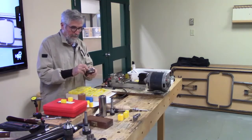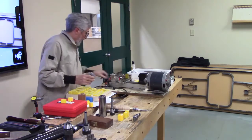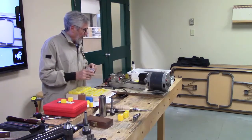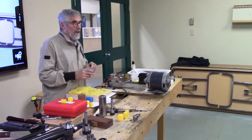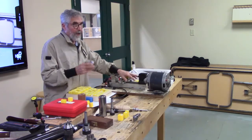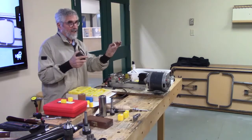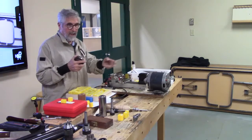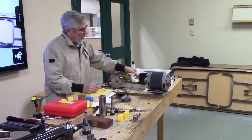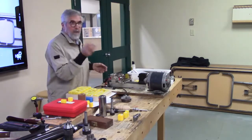But I often will start off with, let's say, a piece of, wherever my pin chuck ended up out there. I started off with maybe a half inch rod there. And so, of course, my collet chuck for this only goes up to 3/8 or 10 millimeters. So I have to first start it off with this to hold it, in order to then turn down a section of it to get it down to what I can grab with my collet, then reverse it around in here, and then take the rest of the metal down until I get right to the diameter of my pen shaft.